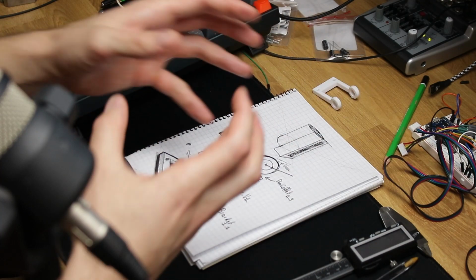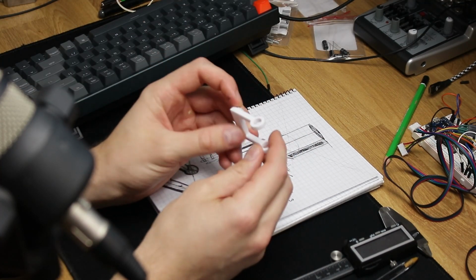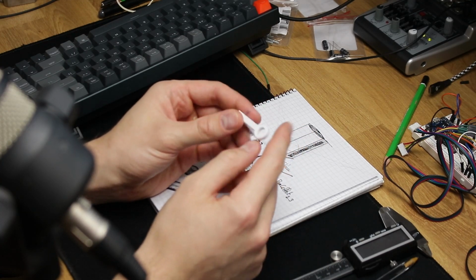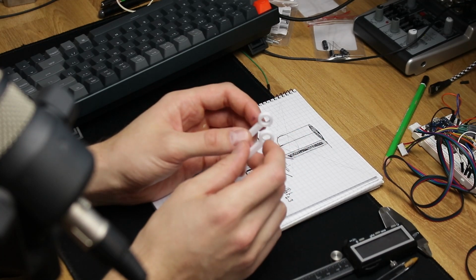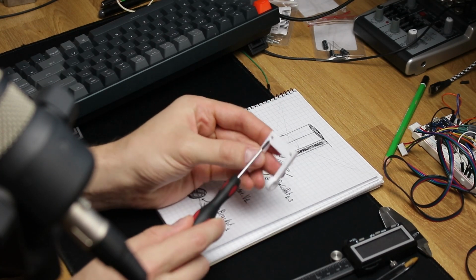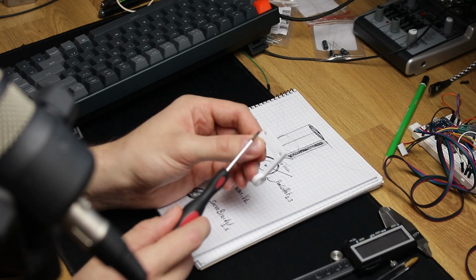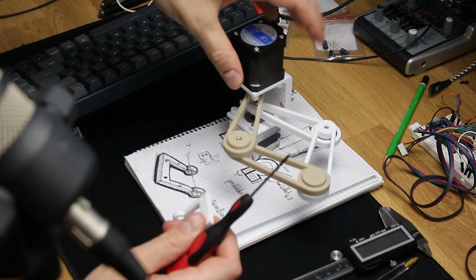And when it comes to the bracket, the thing that the servo motor would be attached to, this was the V1, but we had a couple of issues. This was too far, the holes were not big enough for the actual pens themselves, and it was overall just very janky looking. When it comes to the holes though, these ones, this is just me thinking about the future, and those are M3 screw attachment points that would later allow us to fix it to the robot.